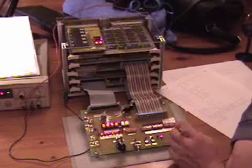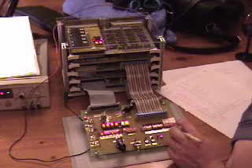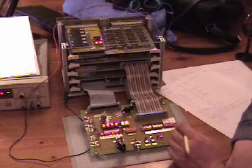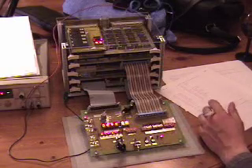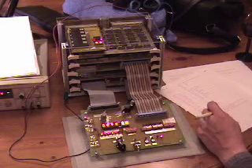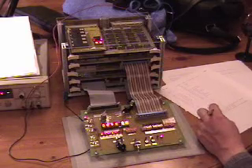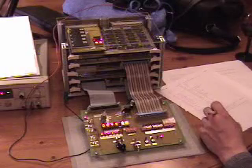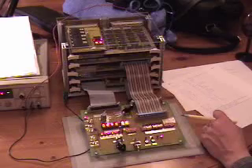The state of the world is things were looking pretty good, but last night I ran into a problem with the conditional branch circuit. The conditional branch was failing — the microcode sequencer was doing an extra instruction fetch when it shouldn't. Fortunately, Andrew Holm came up with a rather nice solution and emailed that to me this morning, and I've just rewired this to use his fix. We will see if that actually fixed it.